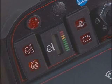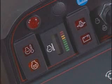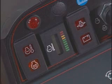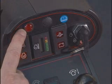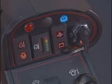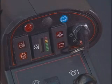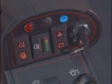During normal operating conditions, the indicator should be in the green range. Anytime this indicator goes to the yellow or red range, the cooling system should be checked. This red light on the control arm is the fault indicator light. But more importantly, from an operator standpoint, it's the leak detector light. So if this light ever comes on during operation, you should move off the fairway, shut down the unit, and contact maintenance. More about the leak detection system later in this program.